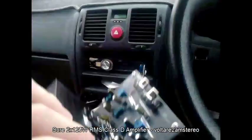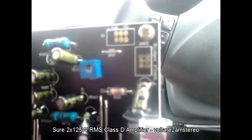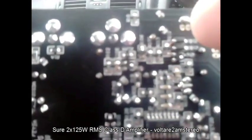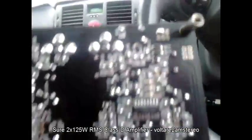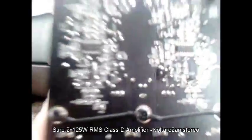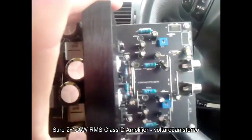There are RCA sockets on this side and speaker output terminals there. There's also a bridge mode option on the board, though they've solder-bridged it rather than using jumpers — jumpers would have been nicer, but it can be changed by desoldering if needed. In bridge mode, each channel should do up to around 300 watts, which is pretty crazy. Later on I'll get it hooked up and see what it sounds like.